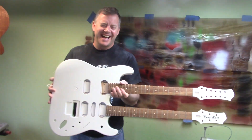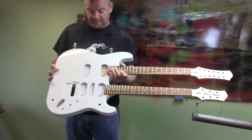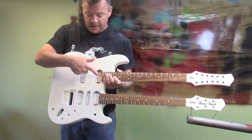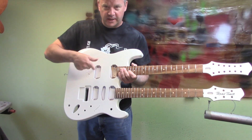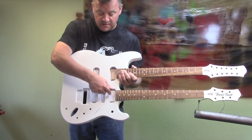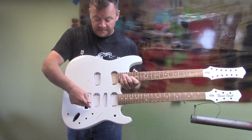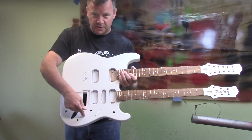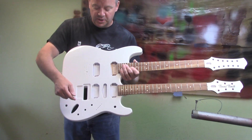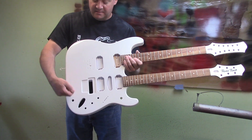And we have to figure out how to wire it — 900 different things that this guitar is going to do. Starting top to bottom: humbucker, humbucker — this is the switch for these two, just a regular 3-way switch. Then humbucker with coil split, single coil, humbucker with coil split — this is the 5-way for these. Volume, tone with push-push for coil split. Push-push is cooler than push-pull — you can just poke at it. Then the jack, and this is the neck control.